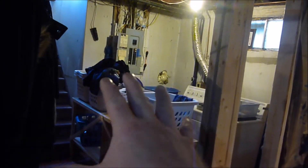The reason I'm insulating between here and here is because that's going to be a semi-cold room. They aren't heating it — it's down in the basement at the bottom of the stairs so there's no reason to really heat it. So the door is going to go across here and we'll just heat this whole area.